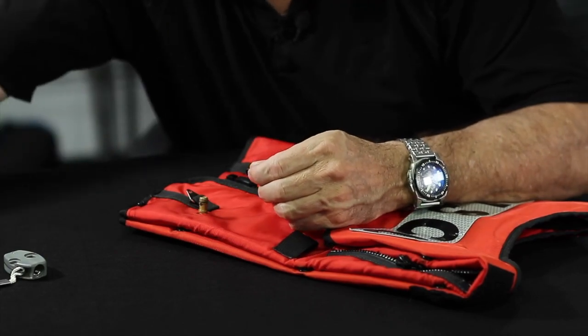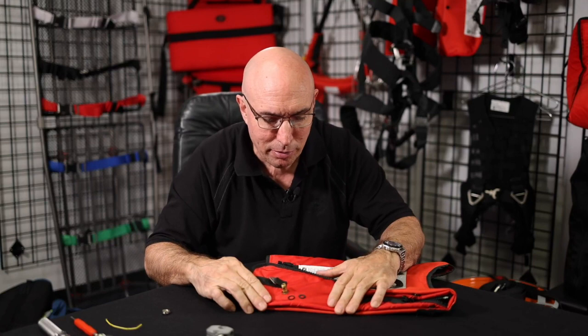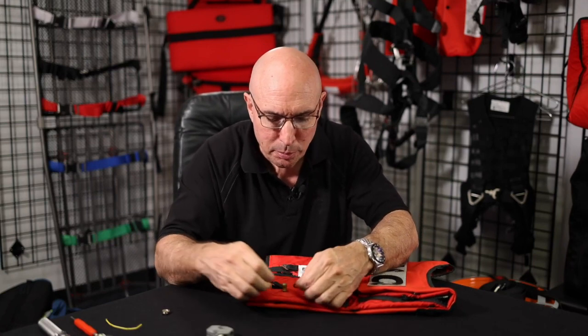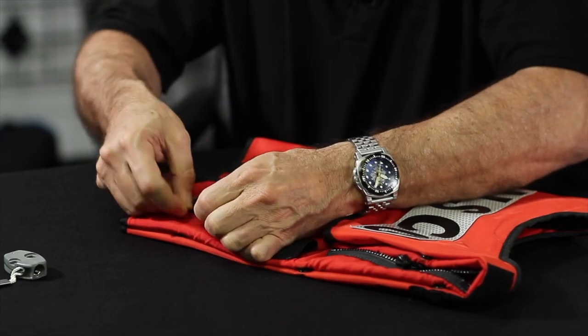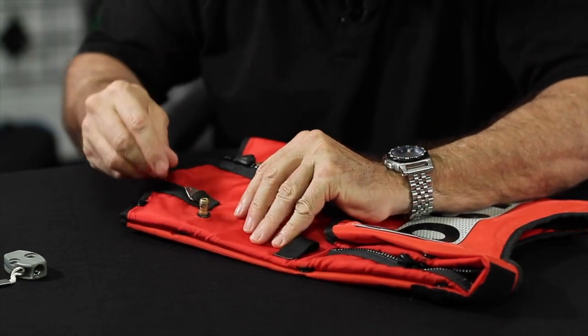So there's a bottom and a top gasket there. The bottom gasket's fatter than the top gasket. That's a 479 kit from us, and you just stretch that around there and make sure it goes all the way to the bottom, because they like to hang up on that lip there. So all the way to the bottom.